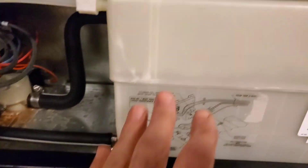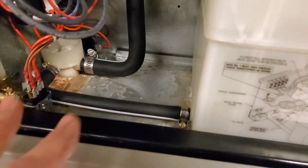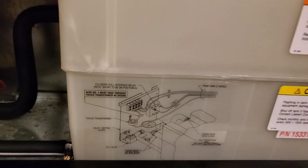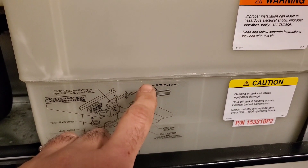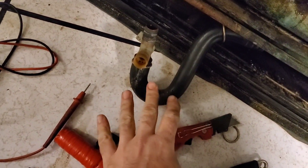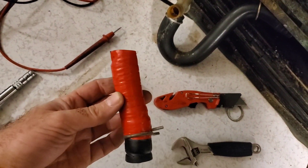The last thing we've got to do is drain the whole tank down and make sure we have no leaks on the drain side as well. I hit the drain button and we can actually watch the level start to drop in the tank. There was a bit of a snag — it wasn't draining very fast, so I pulled this out and I'm gonna clean this trap out.